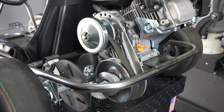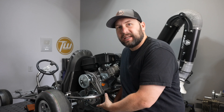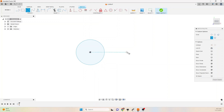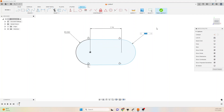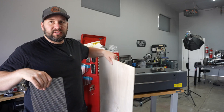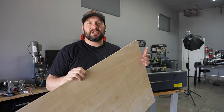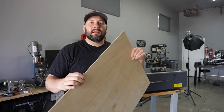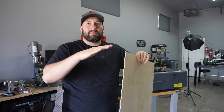Right now let's get back to building that shroud. My first challenge here is going to be measuring this to get an accurate read on the profile around the outside that I'm trying to hit. Because I can laser cut this out of an inexpensive material to test fit, I'm okay to make some assumptions — I'm just assuming two different circles with different diameters that I measured and a spacing between them. In order to create the forming die I'm going to use some quarter inch thick plywood, with a few different layers and some spacers in between to bend the whole thing around.